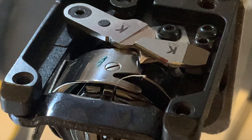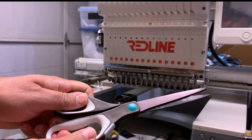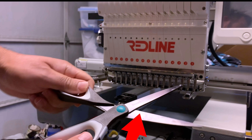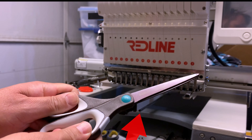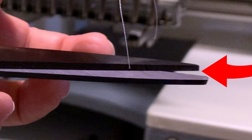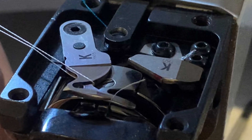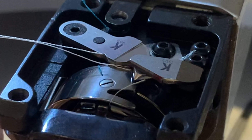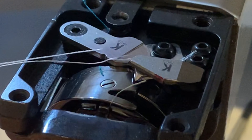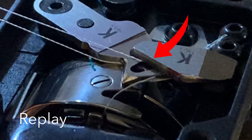The trimmer mechanism of the embroidery machine works very similar to a regular pair of scissors. In order for a pair of scissors to cut, it requires that the two sharp blades have an even friction between them in order to cut things. The same thing happens with the two blades installed in the embroidery machine: when the thread is in between the movable knife and the sharp fixed knife, thanks to the even friction between the two blades, it is possible to achieve a thread cut.